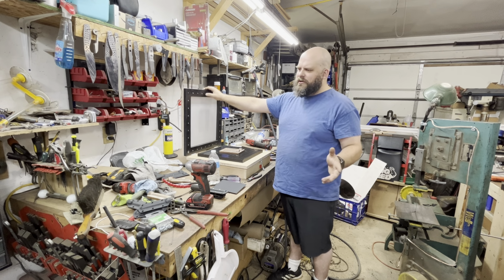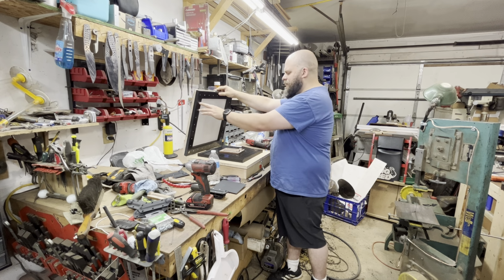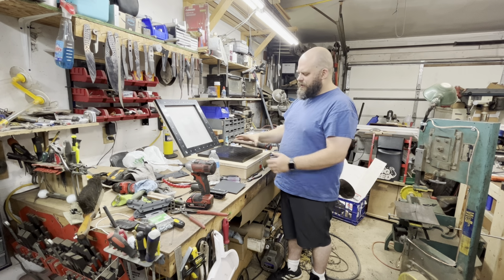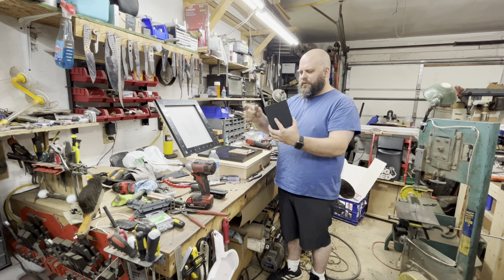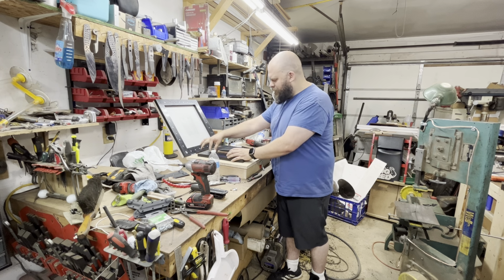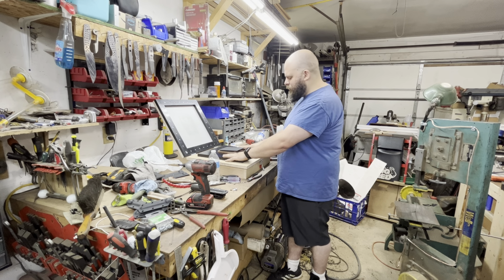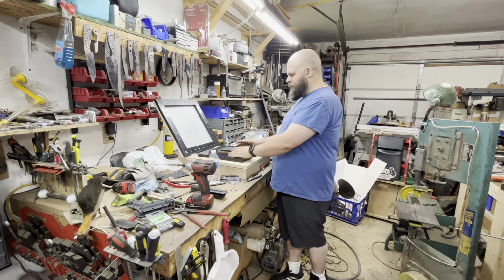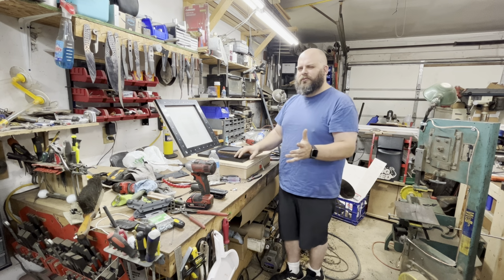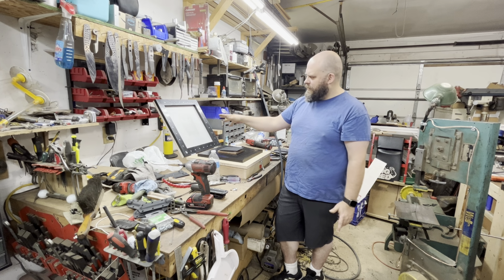Now, this particular press has a silicone membrane. There's another similar process that does not need or use this. It's basically the same press that I have here, just without a lid. And what you're actually doing, you're almost using the kydex itself as your membrane. So you would cut it quite a bit larger than this, maybe give yourself a couple extra inches all the way around. That'll go over your mold and have enough left over around the edges that you then put a square frame around it, press it tight to your vacuum table base, and then when you turn your vacuum on, it'll act like the silicone membrane, sucking itself tight to your mold. And I believe you get a little tighter form using that method than you can with the more stretchable silicone membrane.